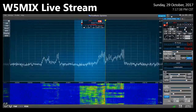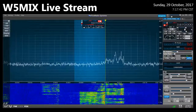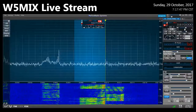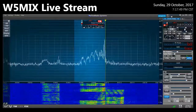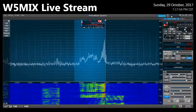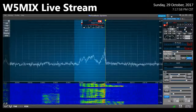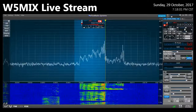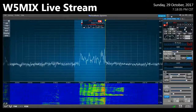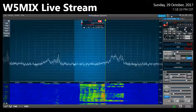Oh, wow. Yeah, well, I'll bet heating that stuff up helped. Did it take the lettering off? Not well. There wasn't any lettering to start with, but no, it didn't seem to hurt them. And when I got done with them, you rinse them off with hot water. Then I set them in the toaster oven on convection bake at 225 degrees for 45 minutes. Let them get good and dried out. Got done with that, let them sit out for about half an hour, stuck them back in the amp, plugged them in, and everything's good.